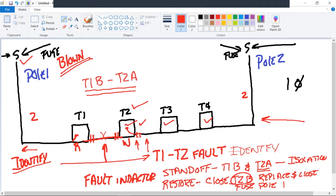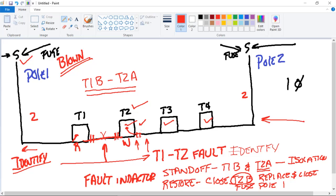Remember, when you get to this job site and you get ready to move open points and move elbows and start re-energizing stuff, you're working with equipment and conductor and tagging that was done by somebody else. You're working for a good organization and they're hitting on all cylinders 100% of the time. Confidence level is high. That's still that 0.1% of somebody that made an error in tagging or put an elbow in a wrong position. You don't want to take that chance. But you back away every time that you get ready to energize something and communicate.